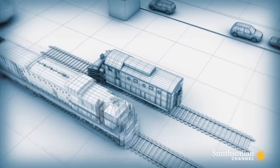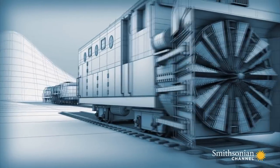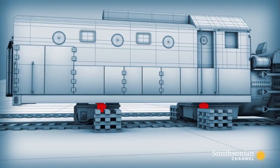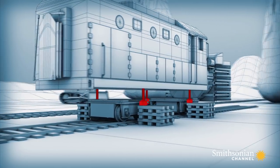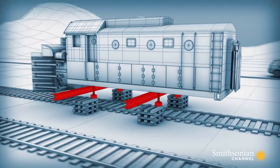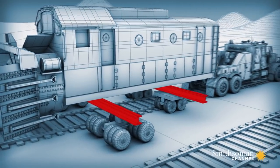This is actually a challenge. It's one of those moves that you're not going to get complacent on and there's less room for error. To get the plow ready for the journey, Chris's first task is to replace the train wheels with road wheels. He must clear all the machinery hanging underneath the plow and position four hydraulic jacks to lift it clear of the tracks. He'll pull the plow's wheels out and insert a steel rig to support it, then attach four dollies for the long, steep drive up Train Mountain.